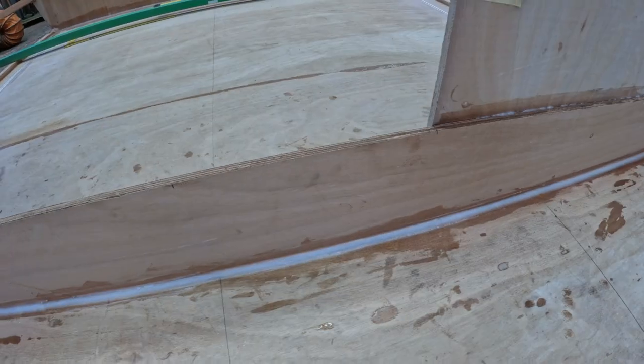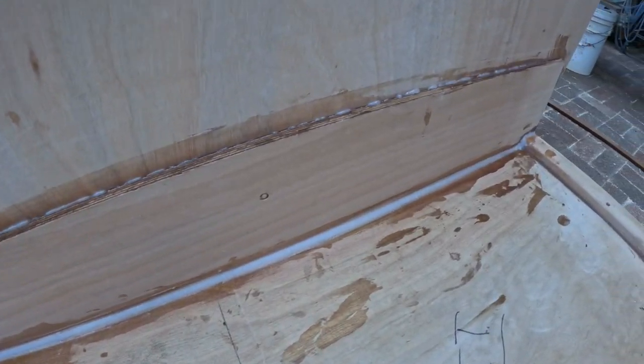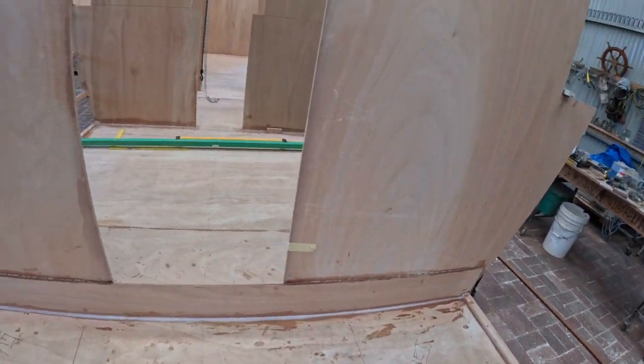I will sand these back, glass tape them, and put larger glue fillets over the top towards the end of the job. At some point, I'll go through, sand and tape all my joints and put larger glue fillets over the top for strength. And then of course, following that, another sand and then some filler, which is easy for sanding and good for painting. I may be able to put the filler in place just before the glue is completely set, which saves a lot of sanding, but that's down the track when I've got lots more framing in, because I'll spend a week or two just sanding, gluing, taping, etc.